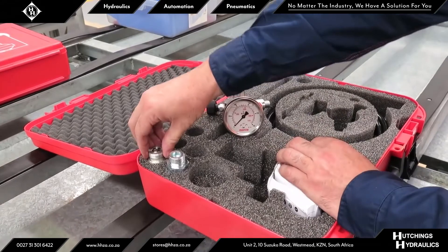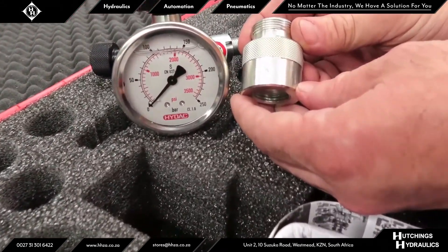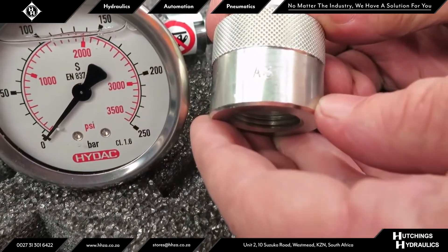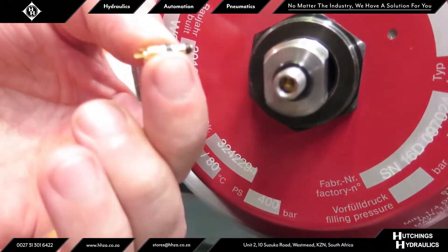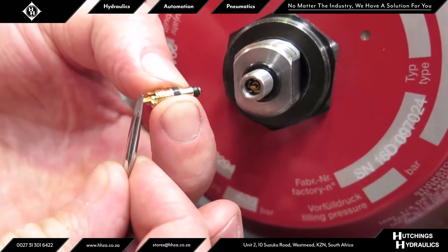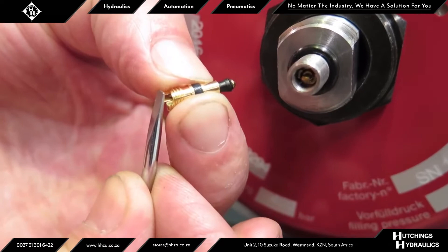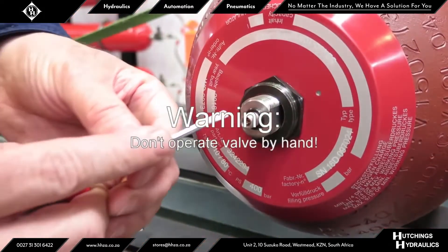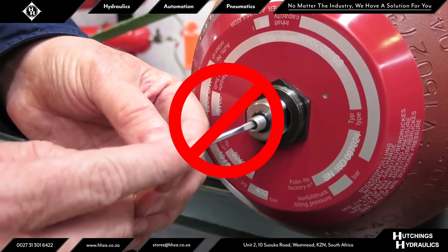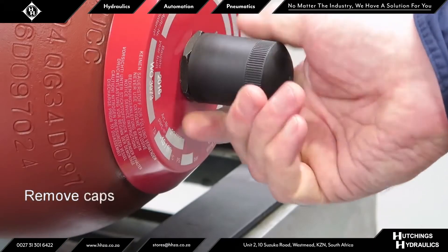The Hardak FPU-01 universal charging and testing unit can be fitted directly to Hardak diaphragm and piston accumulators. The A3 adapter is used to connect to a bladder type accumulator and this adapter is clearly stamped. The accumulator gas valve is opened and closed by pushing down the valve plunger; this will be operated by the center screw of the A3 adapter. Due to the high pressures involved, this valve should never be opened by hand — only use the universal charging and testing unit.